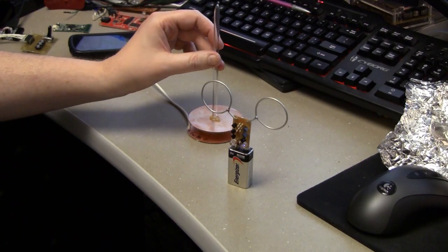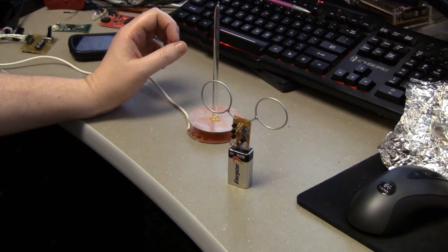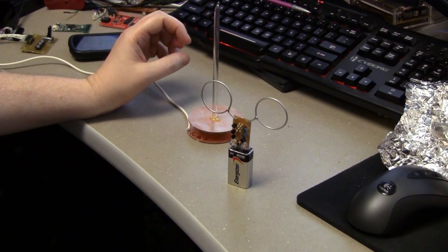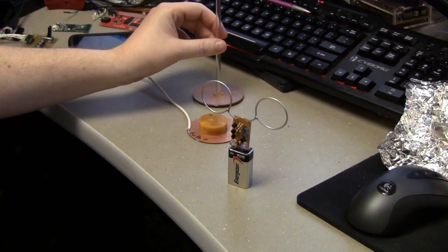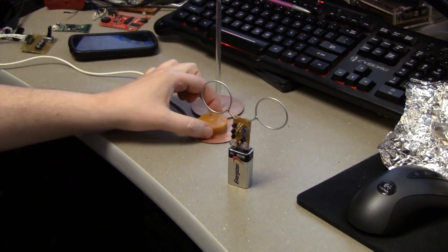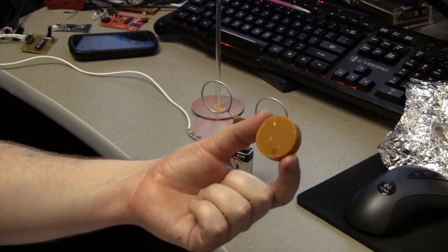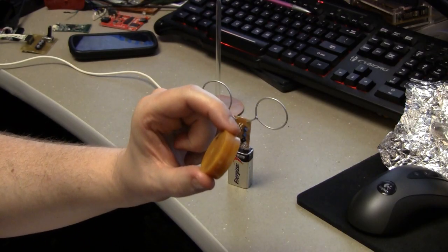There are a lot more things you can do with electrets. I might follow up with some videos about making electrostatic motors and electret microphones — you name it. They're essentially the electrical analog of a magnet — a permanent electric field stored in a physical solid that has a high impedance and will very slowly leak away the charge. Super interesting stuff — more next time.